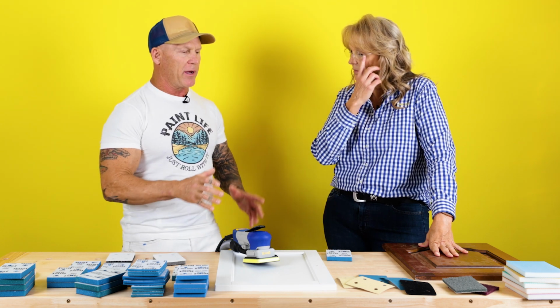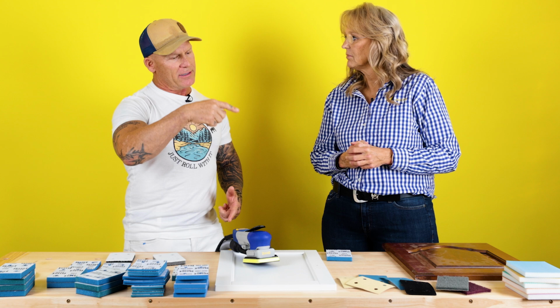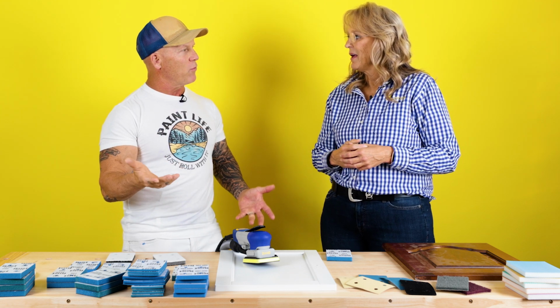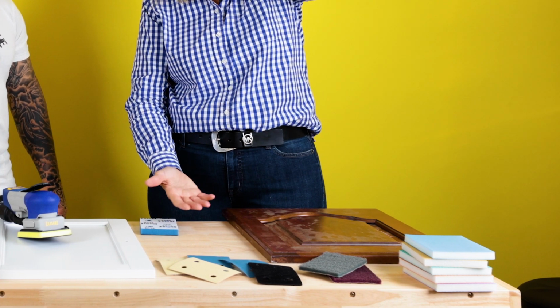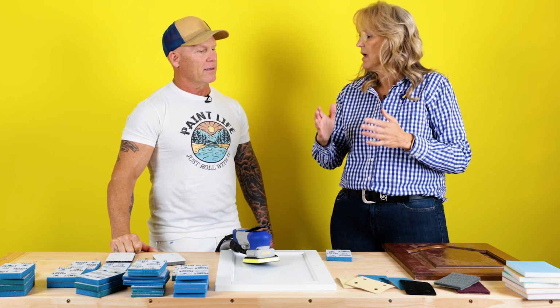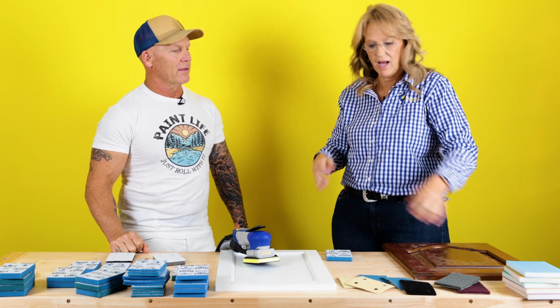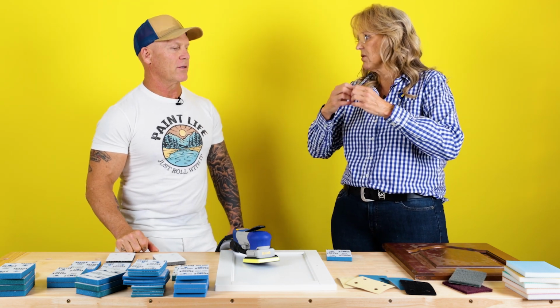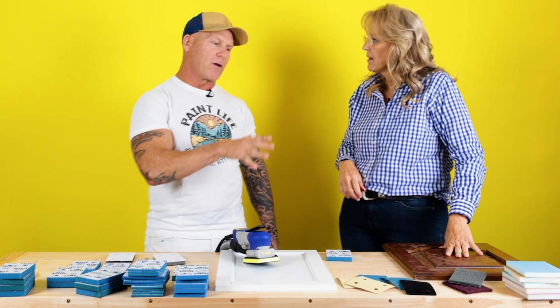So we now have these, are they called woven or non-woven bands? Non-woven. Which is really interesting to me, because I look at that and it seems like a woven material, so what is the non-woven actually referencing? It's nylon fibers, and if you've ever seen it made, you would understand. It starts super thick. Depending on how the fibers are laying, they spray grain, and then they spray their resins. Then it goes through a bed with millions of needles that needle it down into itself, so there's nothing actually tying any of this together. You'll start to see it fray after usage for a while, but that's due to not having anything tying it together. It's just needled down inside itself. That's a pretty cool fact that I didn't know.